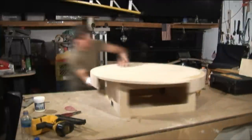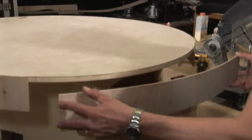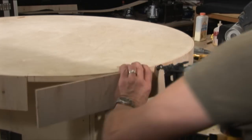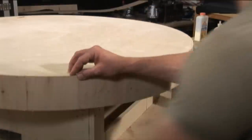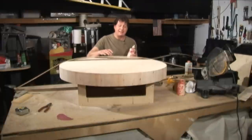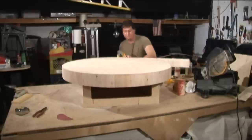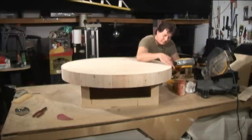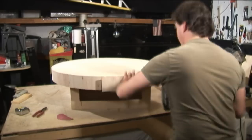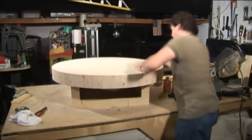Don't forget — have a wet rag standing by to clean up that excess glue. Before you glue it, go ahead and give it a dry fit. That bender board gives this a finished look. I had the extra material, the glue, and the time, so I want to do a second layer of bender board just for added support. When doing a second layer of bender board, make sure you stagger your seams. When doing a project like this, it's always great to sand down those corners to help avoid splinters.